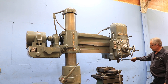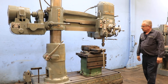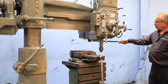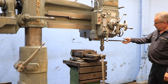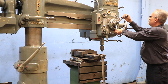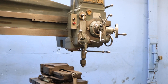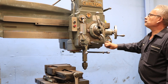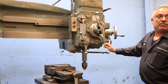He's running the spindle right now. Machine goes from 80 up to 2,000 RPM, forward and reverse. It's number four Morse taper. Spindle traverse is 12 inches. Right there he's power feeding — you have six different feeds from 6 to 25 thousandths per inch per revolution.